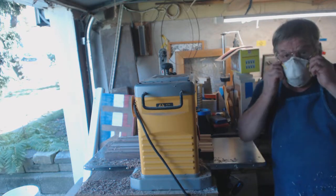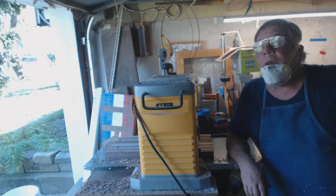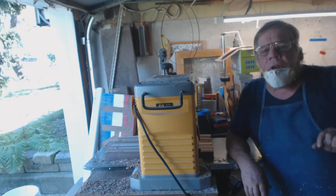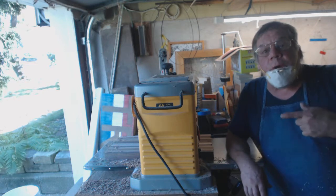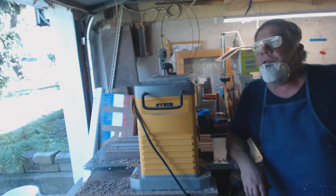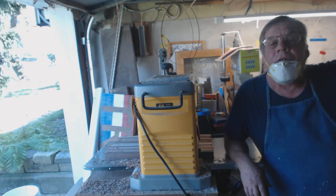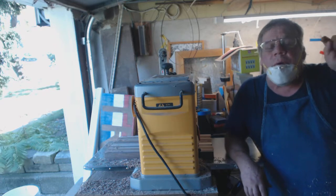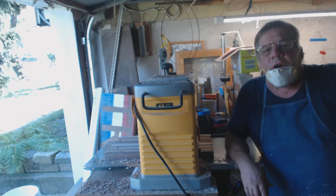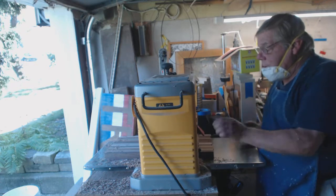That happens because I don't have a lot of electric in my shop, and that tells me that I tried to take off too much in a pass, and the motor was straining. It didn't blow a circuit breaker because everything is fed by surge protectors, so it pops the fuse on the power bar instead of the breaker in the house. So let's try this again.